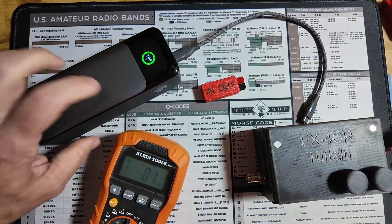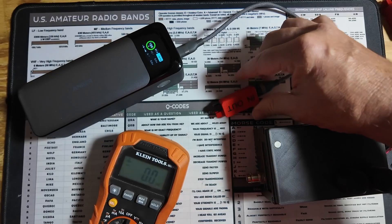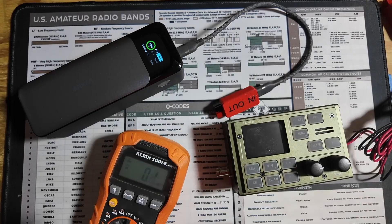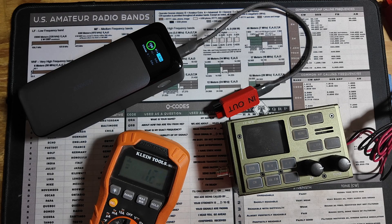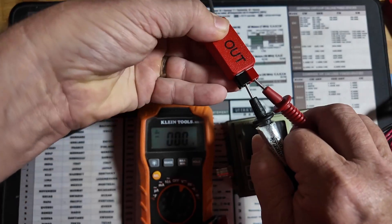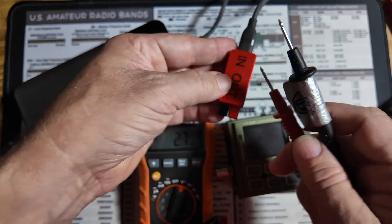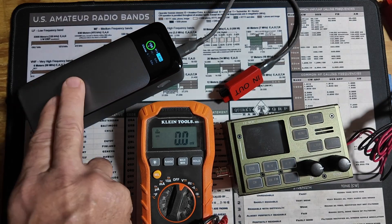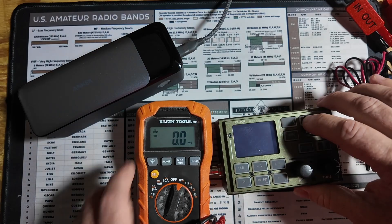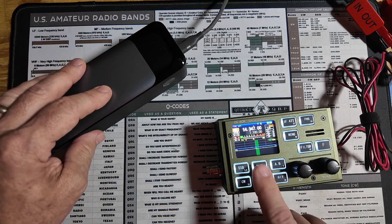Often this is the only battery that I will take with me. I use this for charging cameras, charging phones, and it's nice not to have to carry an extra battery just to run a radio. This is the FX4CR — we'll go ahead and take the cover off of it. Now real quick let's just check the voltage on this guy here. We'll get the probes in and you'll see that we're getting 12.11 volts out of this pack, so this is definitely doing its job in telling the battery pack that we want 12 volts.